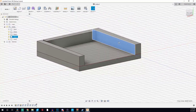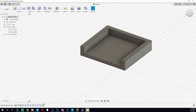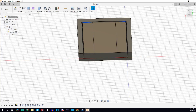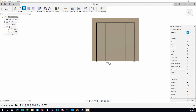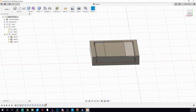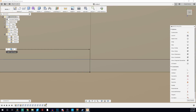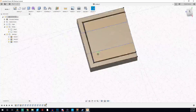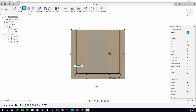What I went ahead and did was grab my digital calipers. I measured the base of the Wyze camera, which is a square — that made it really easy to model since I didn't have to take a bunch of measurements. I measured the length and width, the depth of the base at the thickest point, which allowed me to create a slot to slide the camera into. I also measured where the camera has its little feet or bracket.